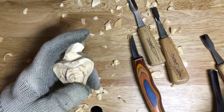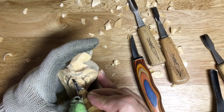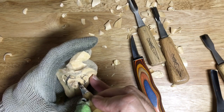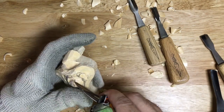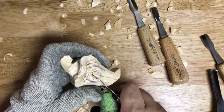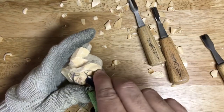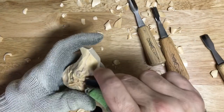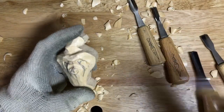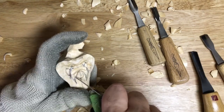Pull those ears down a little bit. Since it's a character we can have all kinds of variation. Mark his nose right here. You can use your knife and just make some cuts in there like this to find the bridge of the nose. You can use a small u-gouge if you have one - we've got some small Dockyard tools - but for what we're doing today we'll just use this and go back in there and deepen those up a little bit. I do like to use the Dockyard tools to put the eyes in, the flares of the mouth, and help determine the bottom of the nose.